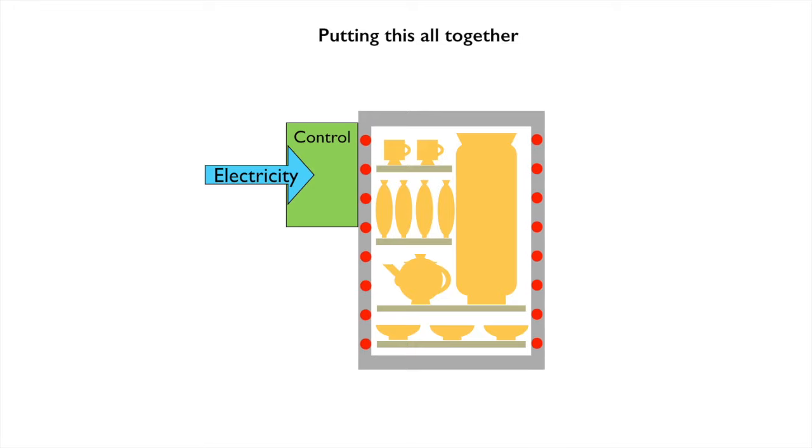They generate heat. That heat then moves from the outside in. All right, this is Fourier at work here, because we have heat transfer through solids. So our heat has to move from the outside to the inside, and it's heating up the air. It's also got a direct radiation factor there, but it's also heating up the bricks that it's in contact with. And so we have our heat that comes in, and it works in the other way too.